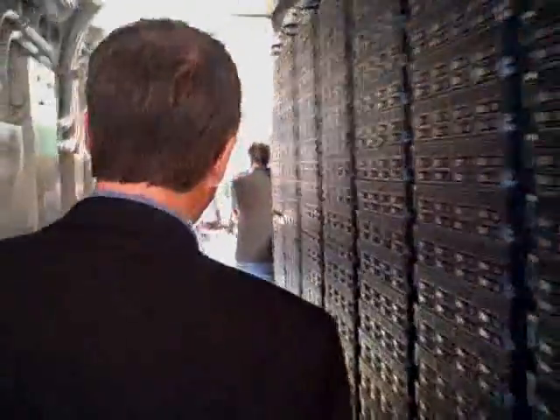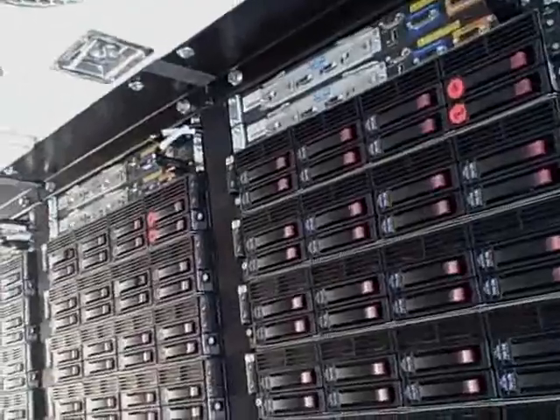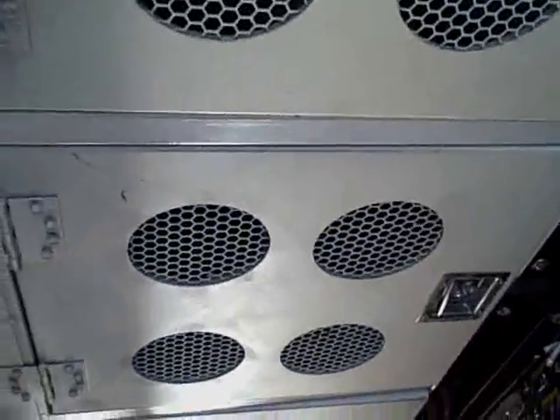Come on through — all of the major components are visible. Above us, we have the blowers, which are bringing the air through. The heat exchangers are on top of the racks themselves. Cold air comes down from the blowers, goes through the IT equipment, up into the hot aisle, and then circulates through the heat exchanger — a continuous circulation. The pod monitors the temperature within its ambient environment and turns the blowers up and down accordingly, reporting that out to the customer's building management system. Interacting with the IT is exactly the same as a normal data center: walk up to the front of the rack, pull out drives, servers, blades. You can access the backs of the racks completely without moving anything — designed to be very much like the environment staff are used to.